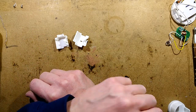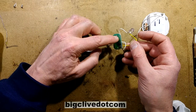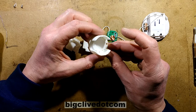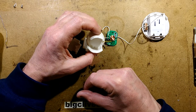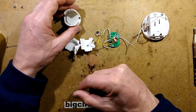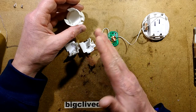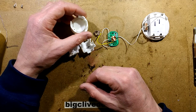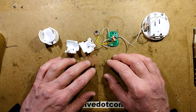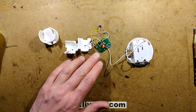I would like to try one of these outdoors. I think the circuitry - water would get into it, but it is shielded from water and grass in a way. You could lacquer it as well, so it could be made sort of outdoor-safe. The LED would have to have lacquer or resin put around its leads to seal it against corrosion. And then you could possibly run it off a little solar panel or something like that. I like the idea of the flame just being affected by ambient wind outdoors. But yeah, it's quite a neat design, this one - it's really evolved quite quickly. It's a really streamlined manufacturing process, and the circuitry is about as simple as it could get.